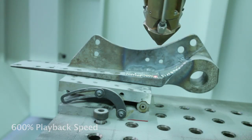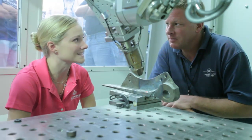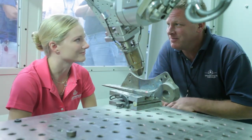So we finished cladding the 420. We put down about four millimeters worth of deposit — I think it looks fantastic. Take it back to your shop, machine it up, test it out. We'll take it over to Reno Machine Company and see what they can do and come back and show you. Awesome, thanks Craig.